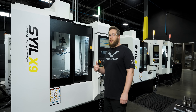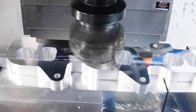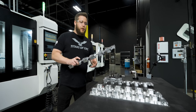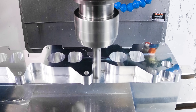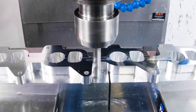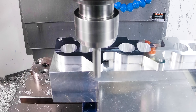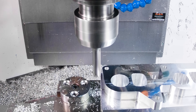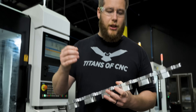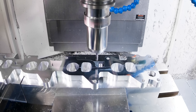Next we're going to come back in with a three-inch face mill and do our finish pass. Then we'll come in with that half-inch end mill and finish the outside profile. You'll remember from op one I said we were leaving stock on that because some of the fillets in these corners are really small and I didn't want to try to stick out a small end mill that far from the first side — no real benefit. So we're finishing this on the second op. Then we're going to come in with a 203 thousandths diameter end mill — just barely larger than 5mm — to pick out all the corners the half-inch end mill couldn't reach. We'll rest-rough those first and then come in and finish all the corners.